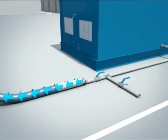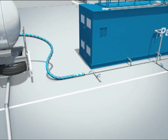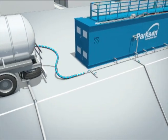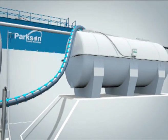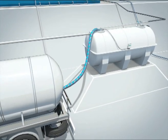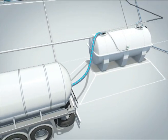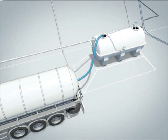The digested sludge must be periodically removed for disposal as liquid slurry, which can be done by emptying through drain pipes with the help of a vacuum truck. Over time, scum and floatables accumulate on the surface of the sump and collection tanks. When this floating layer is exposed to heat, it will dry up and become difficult to pump. It is strongly recommended to remove this layer with a vacuum truck every time one comes to haul away sludge, to avoid inconveniences during rig move time.